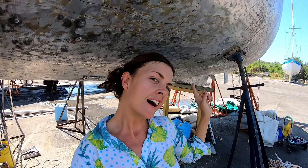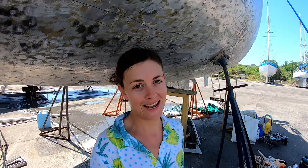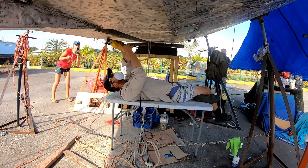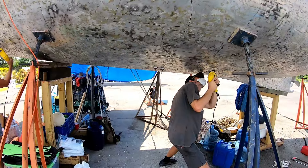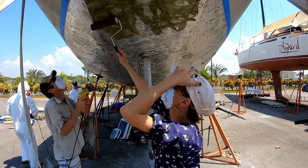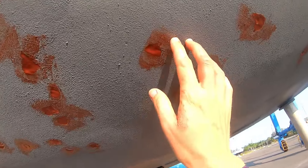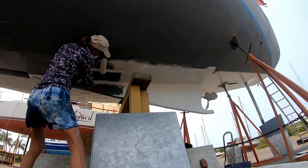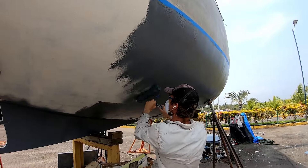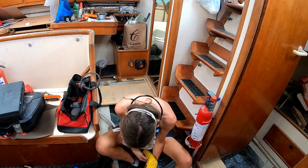We first cleaned out every last tiny fleck of aluminium oxide from the tanks — hundreds of hours of work, just ask Jim — until we got a shiny bright aluminium base to start with. We then used a zinc phosphate etch primer, which not only adheres really well to aluminium but also provides corrosion protection. With that on, we put on our first layer of high-build primer, filled all the little holes, then applied more and more primer building a really thick layer before applying a copper-free, eco-friendly antifoul.